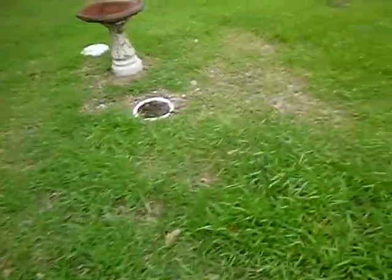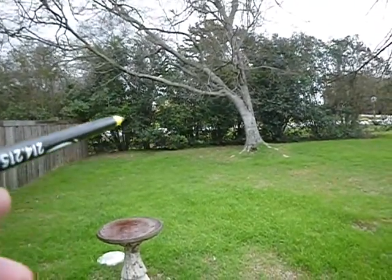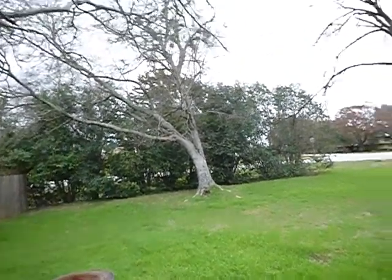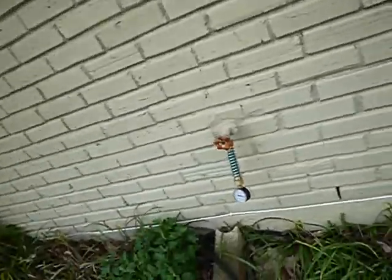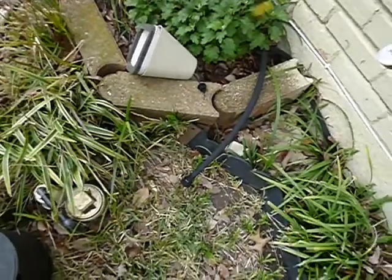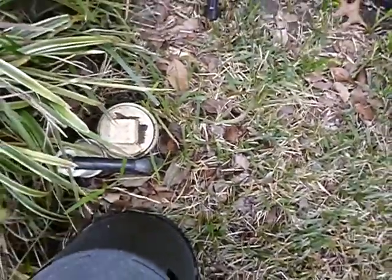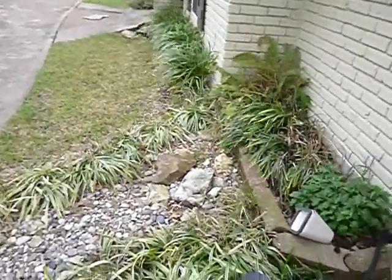The house faces east. This is the north side and north yard. Over on the other side of those shrubs is where the water meter is located. I can't find a main shutoff valve to the house other than the water meter — not uncommon for this age but you should have one. These are your PVC cleanouts to the house. There's also an extra drain here that is apparently for the salt water filtration system we saw at the beginning.